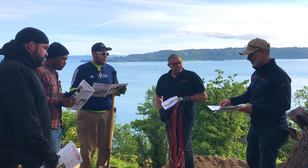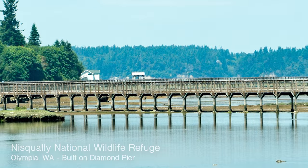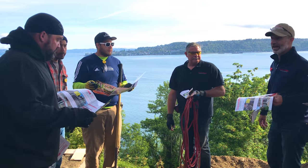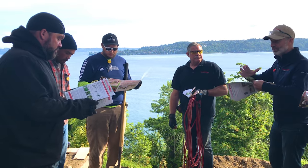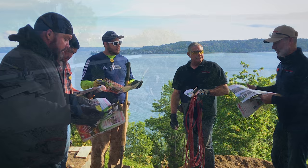We've been around for a long time. On the commercial side, we've been doing this for 30 years. For you guys out here, since you have a more complicated site where you want to hold the side of the hill together, Diamond Pier works well because of this pin pile technology it's based on. The pins are at cross angles, so it's transferring the load through the concrete head down into the soil.